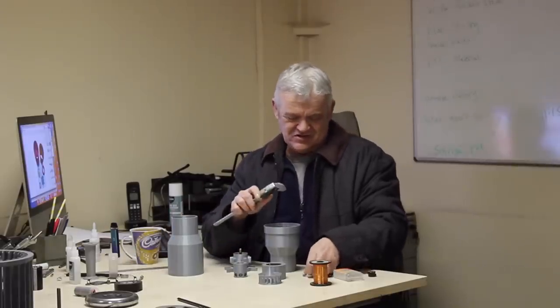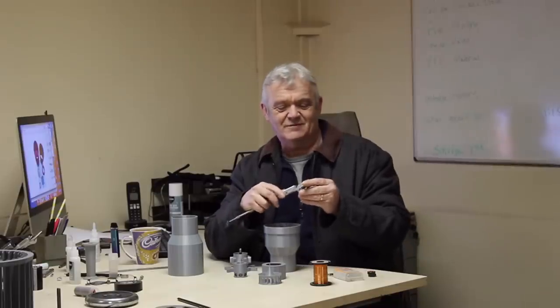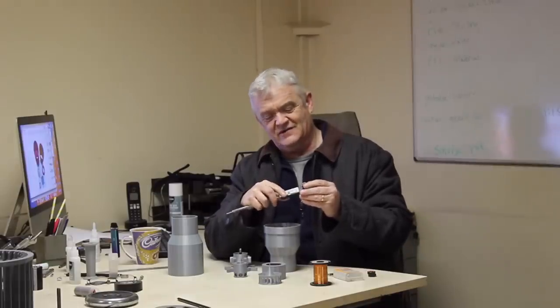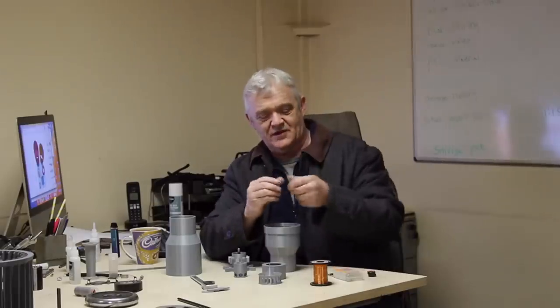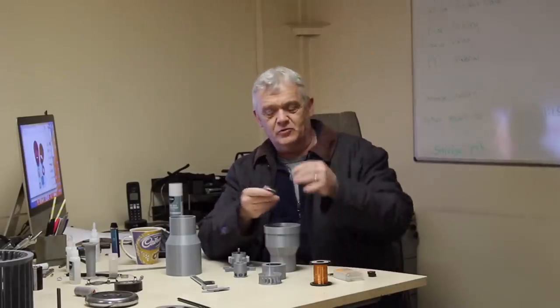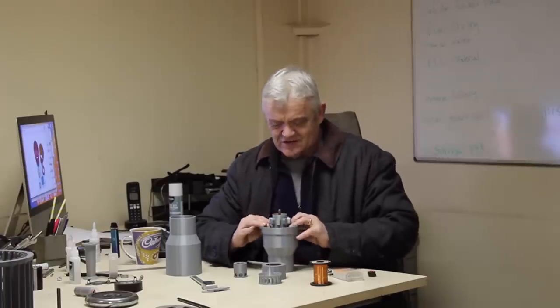This is the actual stator and we're going to wind a coil around there like we've been doing with all of these serpentine coils. Right in the center you can see a little bit of bar — that's for the rotor to ride on — and the bottom is a thrust bearing. The thrust bearing is 35mm on its outside diameter, 20mm on its inside diameter, and 2.5mm thick — I just picked it up from Amazon. It's two flat plates with a ring of ball bearings in between.